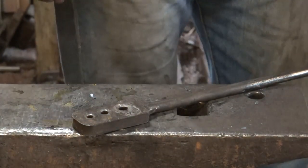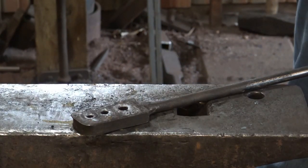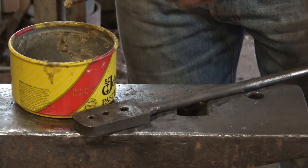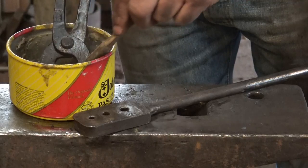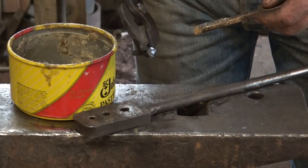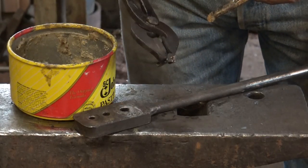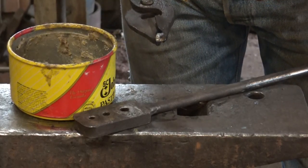So you get the idea there where we're going. If these are still hot when you're done, it's a simple matter to put a little bit of wax on them. You can use beeswax, you can use a linseed oil mix. I like Johnson's paste wax for no particular reason other than it's super convenient, and it does a pretty good job. So there's a nice waxed black bolt, matches the hinges exactly because I use the same wax treatment on my hinges. If you're having things powder coated, you can leave the wax off and have the bolts powder coated or painted.